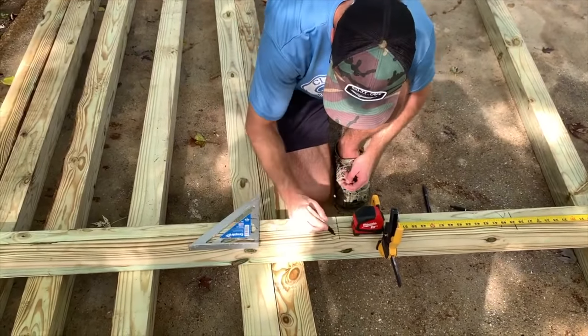So to do this, flip a full shingle over and then cut it in half lengthwise as shown. Here I am taking another shingle and repeating the process by flipping it over, taking a utility knife, and cutting the shingle in half lengthwise. Now, we're only going to use the half of this shingle that has the adhesive backing like I'm showing here. That adhesive is going to help to hold the shingle course that we install on top of it down in place. I needed 4 starter strips for this shed, so I cut the remaining 2 as shown.